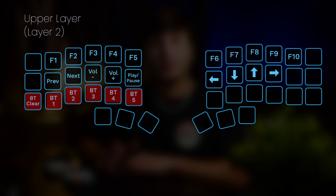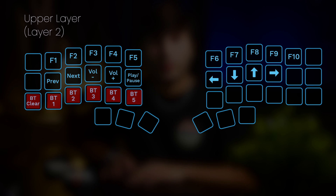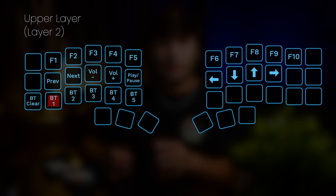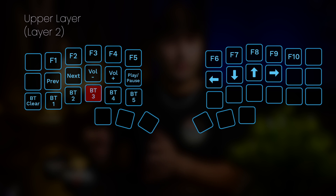I also have my Bluetooth control keys here as well. With the ZMK firmware running on this keyboard, you have access to five different Bluetooth profiles. Each profile allows you to pair the keyboard with a different device. I have five keys here that when pressed will activate that profile. You first activate the given profile and then pair the keyboard with the device. For example, I can press on profile one and connect my keyboard to my MacBook, press on profile two and connect my keyboard to my phone, and press on profile three and connect my keyboard to my iPad. Only the device that is associated with the active profile will actually receive keystrokes.